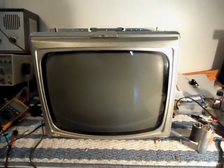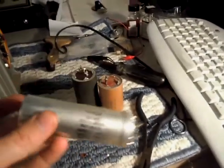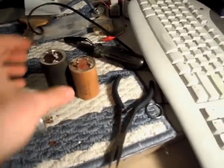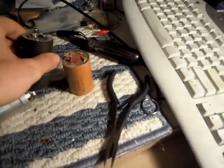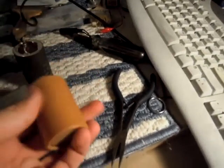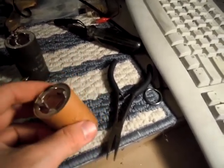I just finished installing the power supply electrolytics. Our old multi-section cans here — this was the shorted one. Here's the original part of the voltage doubler, and here's another part of the voltage doubler that somebody installed at a later date. It's still very vintage, but somebody serviced the set.